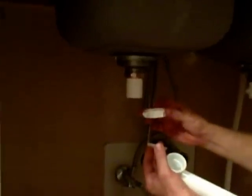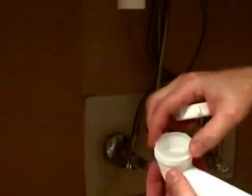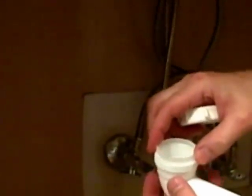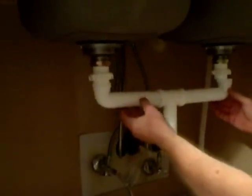On the tail piece, we're going to put a nut and a washer pointing down to the next piece. I prefer the nylon washers — they're beveled down, and that smaller bevel goes into the slip joint. When you compress it, it gives a wonderful watertight seal and doesn't dry out and crack over time like rubber does. We'll slip on our nuts and put the washer on with the beveled edge down, then check the spacing for the center outlet.